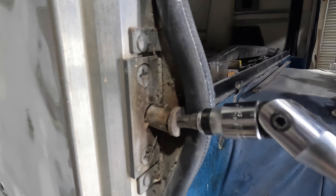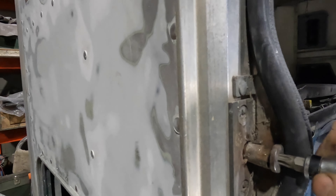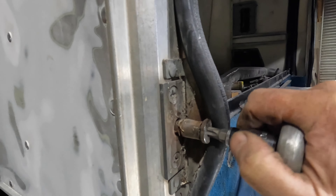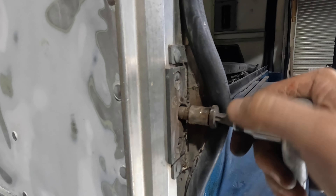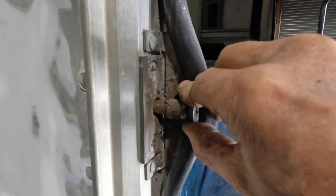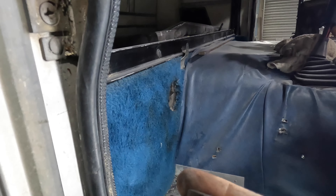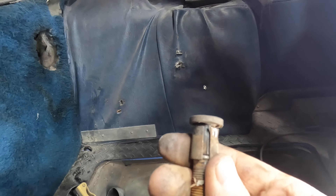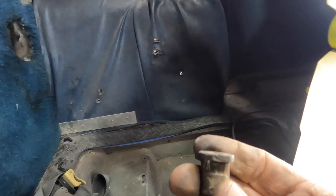I found the right tools - luckily I have a few things. Just going to see what I've got to fix this up with. The one on the other side is pretty cumbered. I'll have a go at tidying these things up - I've got time. That one's not too bad, worn a bit. It's been a long way, done a lot of rattling. After a bit of investigating - see, it's quite a special design. It's got a groove up inside here where it fits. Had a hunt around down in my lathe room and got a box of these - about the right size, slightly shorter but the jaws on the door are going to disappear up into there, it'll work.